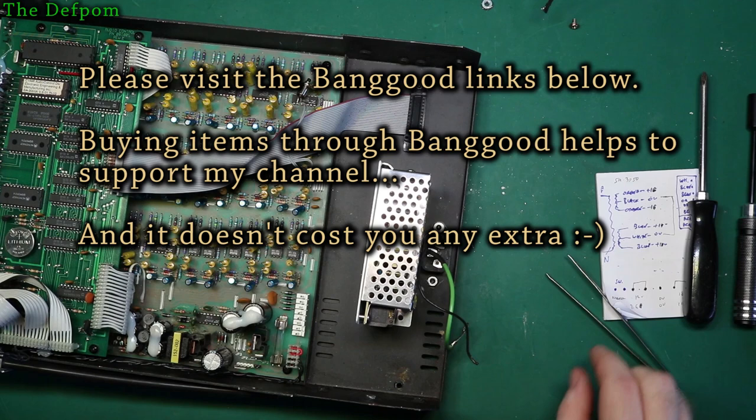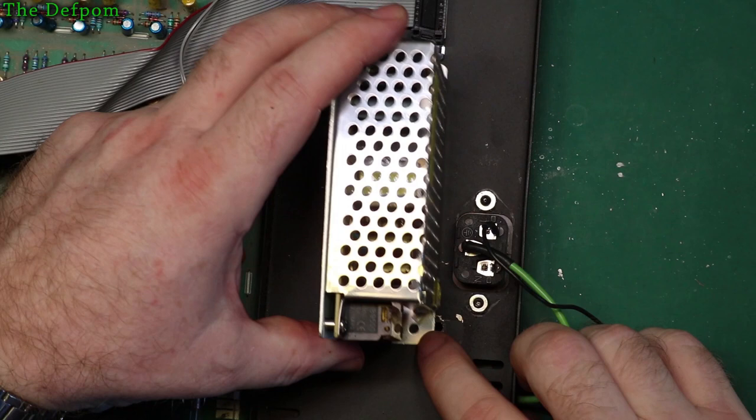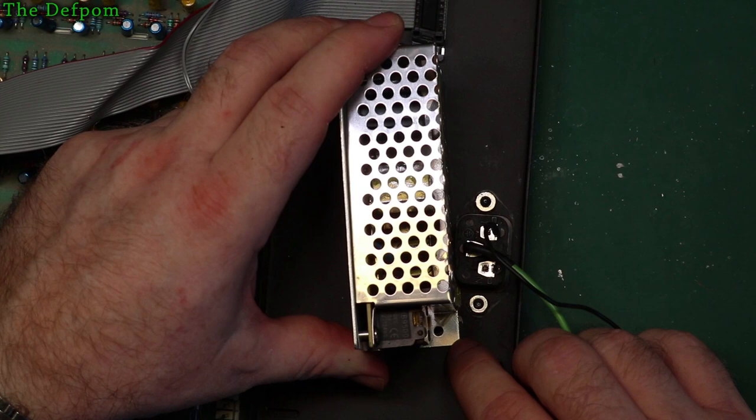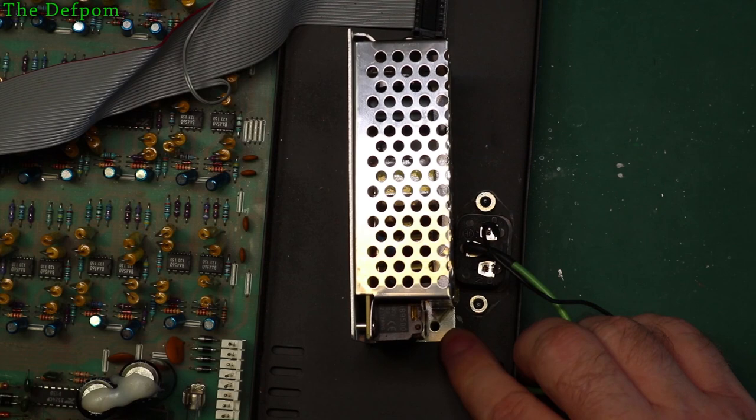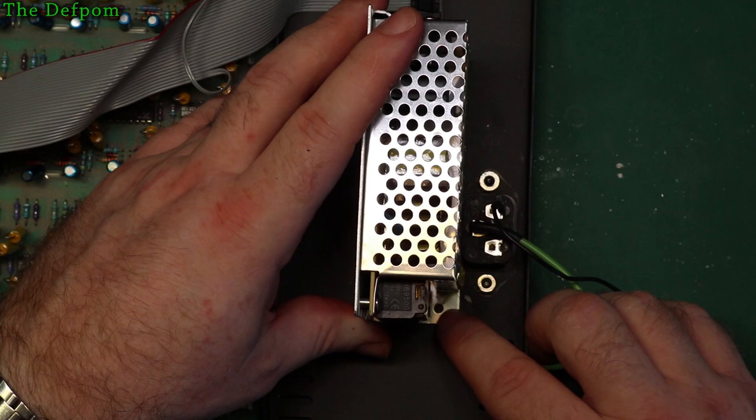Anyway, so there's the hole, which I want to try and get onto. That hole right there, so that's the hole I want to go to, is the chassis there. See, that don't quite line up. If I line it up like that, see, it's actually slightly offset. Probably can't see really well there because of the lighting, but it's actually a bit wonky if I get it straight. Right, that's how it's sitting. So if I elongate the hole in this piece here, in the aluminium, not by much, I only basically put another hole right next to it, and that will then line up perfectly, okay?